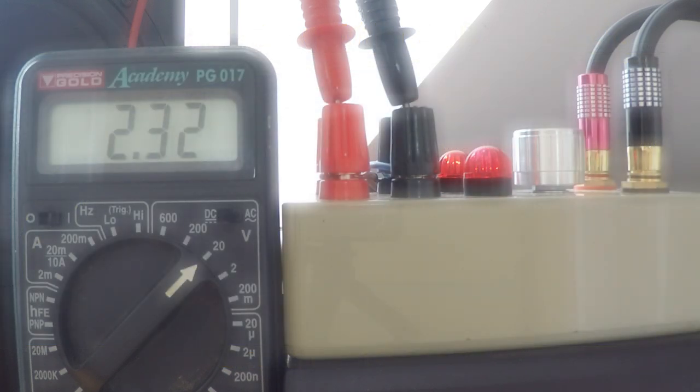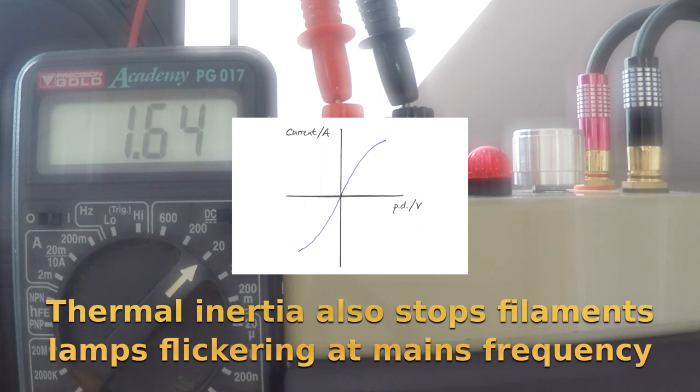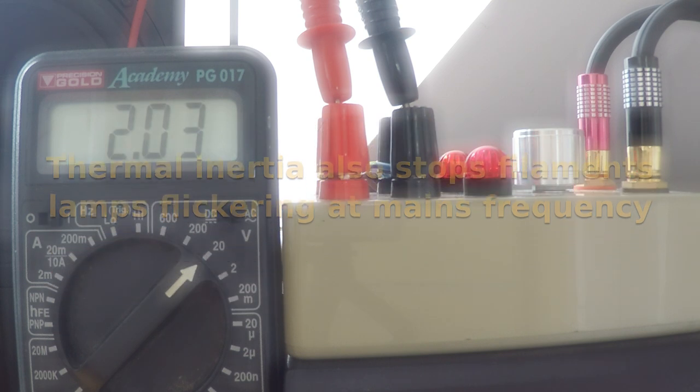Now for the distortion tests. You might think that the compressor would have a fairly high level of distortion, as the resistance of the lamp filaments is, after all, non-linear. The key here, though, is that the thermal inertia of the filaments is high enough to keep this non-linearity from raising its ugly head within the audio band.